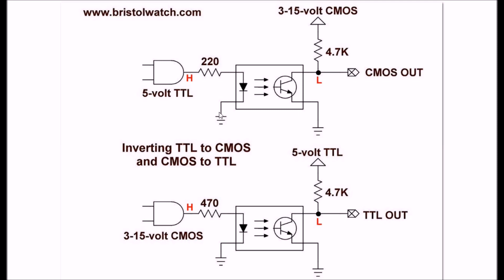It sources the current. When the LED is turned on it will turn on the phototransistor. You notice that in the circuit here is the voltage, here is the load, and this switches the ground. The output is what we call sinking the current, because when the switch is turned on it provides a path to ground. So if I have a high on the input when it's configured like this, there will be a low on the output — this basically inverts my logic level and also changes my voltage level. So this could be a 3 to 15 volt CMOS circuit being driven by a 5 volt TTL circuit.